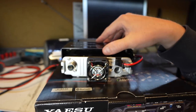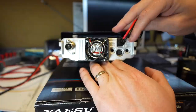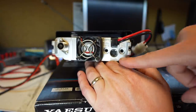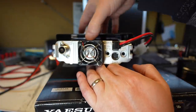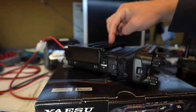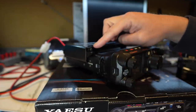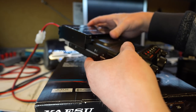Around back here, you actually have a decent amount of ports. You have an antenna port, which you expect, your power, and you've got an external speaker in the back — external speaker B and A. So this is for stereo audio. Yaesu sells a speaker that's split for B and A channel audio. Then you have a data port, so this will do data as well. Whether that has full CI-V control for PTT in the radio, time will tell. And if you liked the FT-6000 mobile radio, that bracket is back again with the kind of lever here. You mount this bracket somewhere, push the lever down, and the whole radio slides off of it. So if you were a go-box enthusiast, you could mount this, have another extra rail set — one in your go-box, one in your car — and just slide it in and out as you need. It's a really simple install.